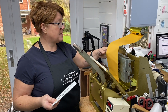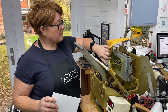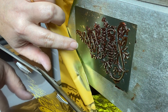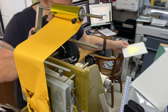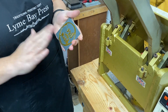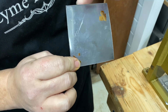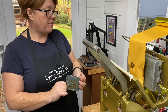This particular plate has been sitting on this machine for two days and has been heated up fully each day. Apart from where you can see some of the polymer from the base of the plate, and where I managed to get foil on the actual design when I put it on the wrong way around, it's not moved, it's not gone gooey, it's not broken. If I grab another plate that's already been on the press from another one we were testing yesterday — which, because it wasn't on as long, hasn't gone as dark — it prints just as well. You only need a very small amount of die bonding tape to attach your plates to the machine and get perfectly good results.